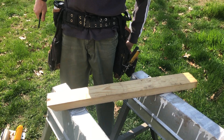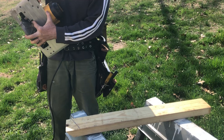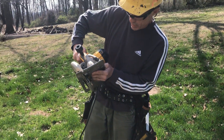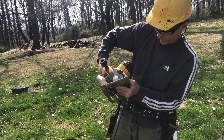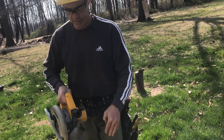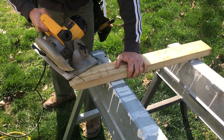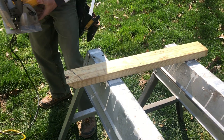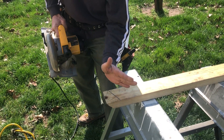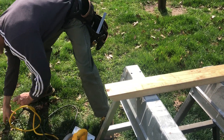Now we're also going to rotate the saw at 22 and a half degrees. We take the saw and tilt the table to 22 and a half degrees as well, locking it into place. We set everything up carefully — the saw is going to cut at a bevel while we follow the miter line. Then we plug in the saw and demonstrate what this looks like.